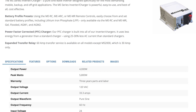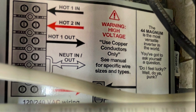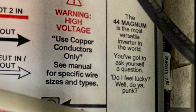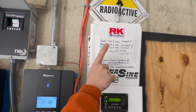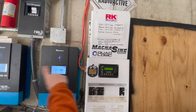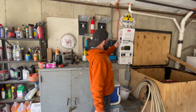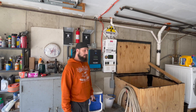Mainly it goes up to this — our inverter charger. This is a really nice, heavy-duty unit; it's pretty badass, a real good standalone unit for off-grid applications, way over-engineered. The thing weighs 80 pounds. This takes the power from DC and kicks it out as AC up at the house. Conversely, when we turn the generator on, the AC coming in from the generator gets fed into the inverter, which charges the batteries while also powering the house.